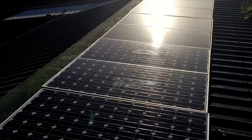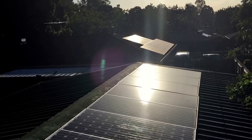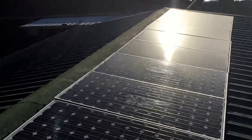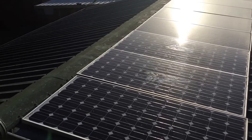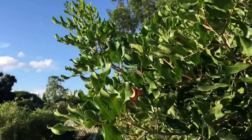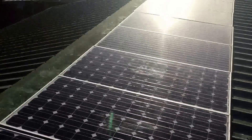These are my solar panels. I've got 8 190-watt panels, and I've got another 24 over on the other side of the house — you can't really see with all the glare. These panels here are facing due north, so they're the best possible for collection. There's a bit of shade from the trees early in the morning, but being in parallel doesn't hurt them too much.